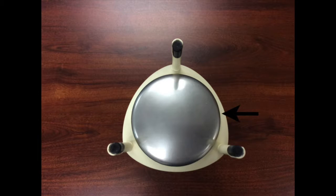The precipitation sensor is measured using the Vaisala RainCap sensor technology. The sensor comprises a steel cover and a piezoelectrical sensor mounted on the bottom surface of the cover. The precipitation sensor detects the impact of individual raindrops, and the signals from the impact are proportional to the volume of the drops. Hence, the signal of each drop can be converted directly into accumulated rainfall. Noise filtering is used to filter out signals not associated with raindrops. Measured parameters include accumulated rainfall, rain current and peak intensity, and the duration of the rain event. We only return the accumulated rainfall to the data logger.